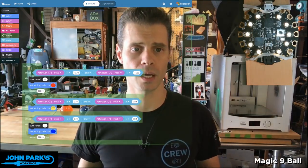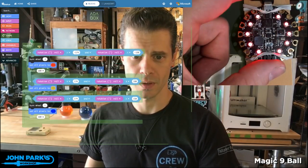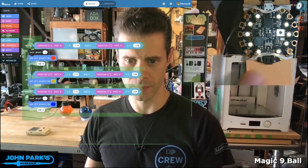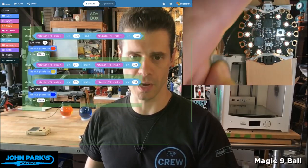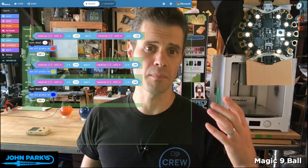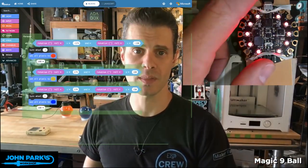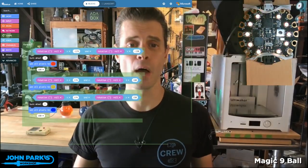I've also got some color coding going on with the NeoPixels. Here's a demo — I'm going to use this to scroll my window up and down, which is a really handy use of any mouse scroll wheel. If I press and release it's going to stop because I have rubber bands returning it. This could be really useful for accessibility, creating output for music controls, or maybe put in a power glove so you can change a filter using up and down motions. There's a lot you can do with just measuring roll using the accelerometer on the Circuit Playground Express inside of MakeCode.